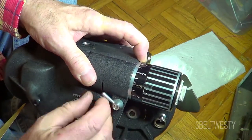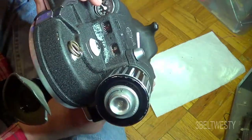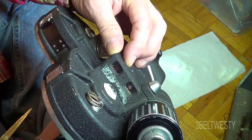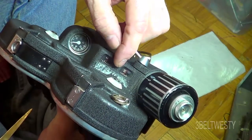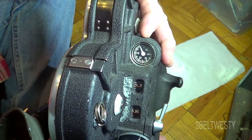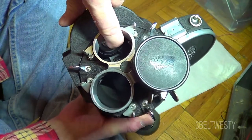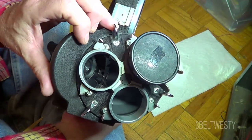To put the motor back in, there's a key right here — that feature goes in like that so it's flush and it locks. This particular model was for Europe, so it's in meters rather than feet as in the USA — this is 30 meters. The frame counter reads about 33 to 35 meters. The tachometer here — most of them go to 50, some go to 60. There's the mirror down in there. I was doing what you shouldn't be doing — touching the edge of it to spin it. It's got a spinning bow-tie mirror in there.